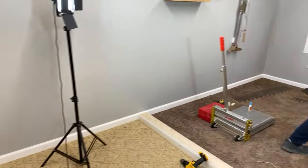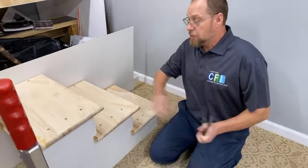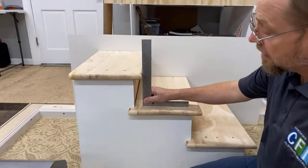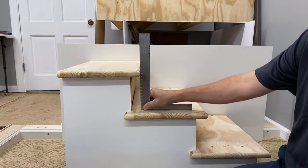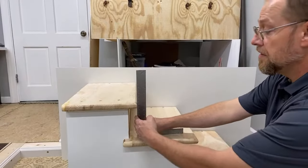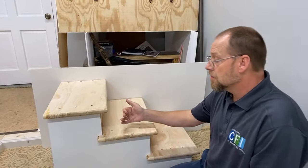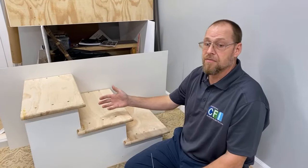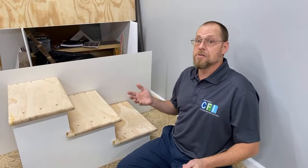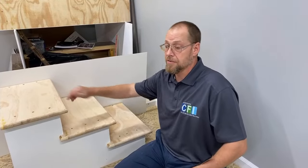Let me show you right here — this is not a 2x12 but it's rounded. You need to actually build out this void right here so that it goes straight down, just like this framing square does, in order to apply your stair nosings the way manufacturers recommend. Rather than building this out or sawing it off flush with the riser — which is time consuming and costs money for materials — I came up with a little solution where you can make these out of your own vinyl plank flooring.